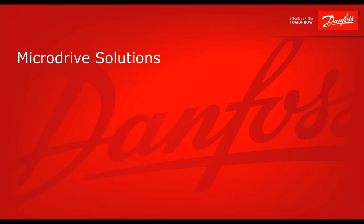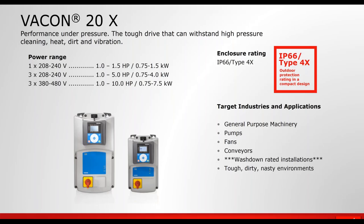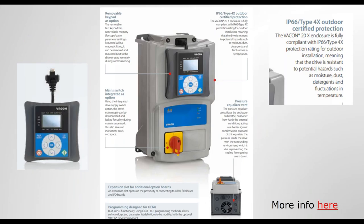Let's define a micro drive — usually an inexpensive drive, maybe under 10 horsepower. The Vacon 20X is our NEMA 4X micro drive solution. This drive was built from the ground up to be NEMA 4X. It is a very full-featured drive, especially for a micro drive. It caps out at about 10 horsepower three-phase, and it will convert single-phase to three-phase power up to 1.5 horsepower. The keypad is removable as an option and can be mounted in any position — right side up, horizontally, or upside down — and has been tested in all those positions.